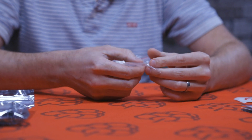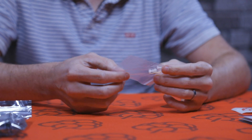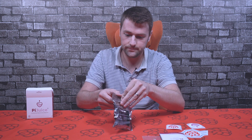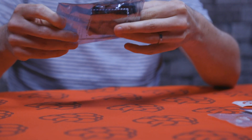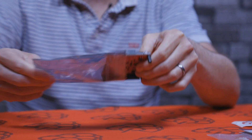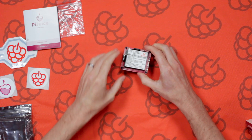We've got some screw mounts and there's a little pogo pin here. If you've got one of the older boards like the 3B, you might want to use the pogo pin to reset the board if you're powering the Pi Juice through the Raspberry Pi. So let's take a look at the main board itself.